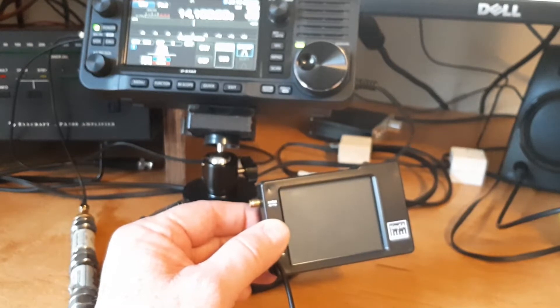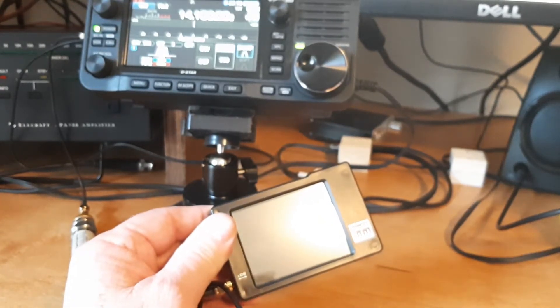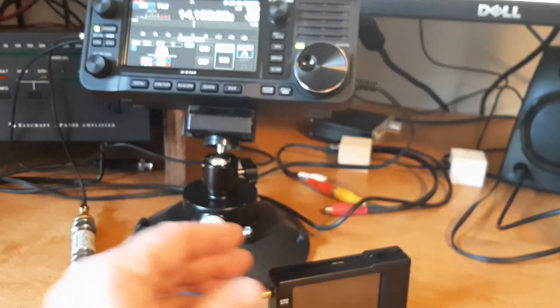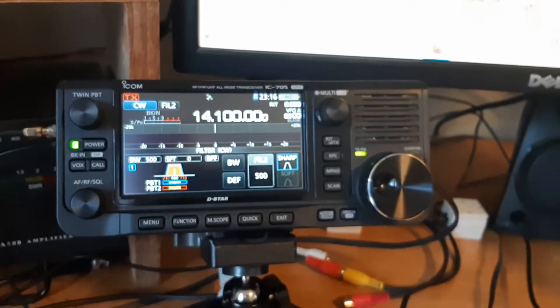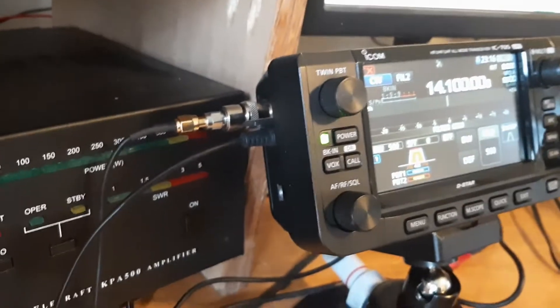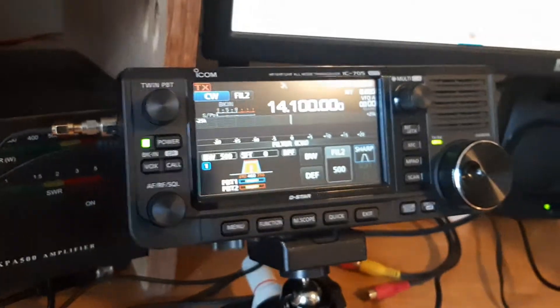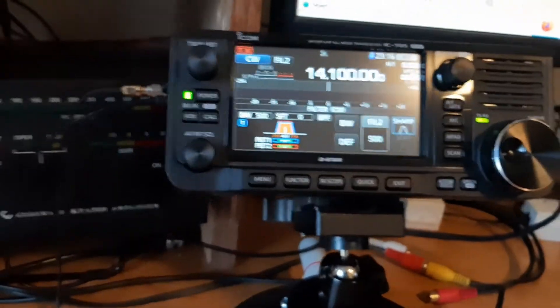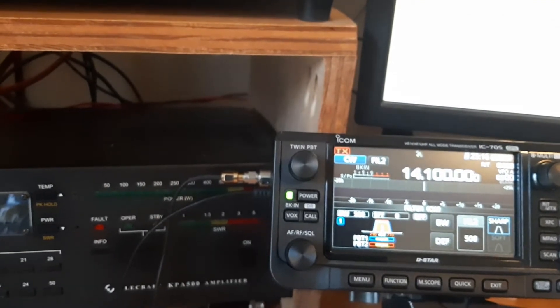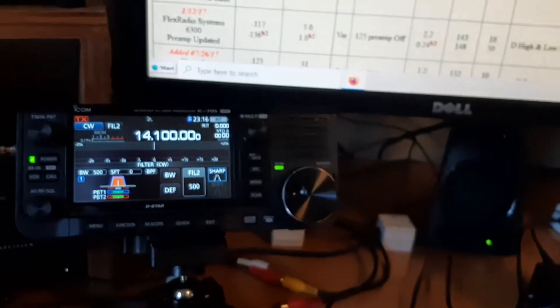It has what is called a low output mode — we're not going to be using the high output mode, just the low output. I'm going to be putting it on 14.1 megahertz, the same frequency as the receiver is currently tuned to, and then injecting a low-level signal through external attenuation into the antenna jack. The idea is to find out just how low of a signal we can inject that will produce a 3 dB change in audio output — 3 dB compared to the signal being there versus just noise. That's the MDS.